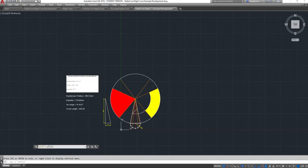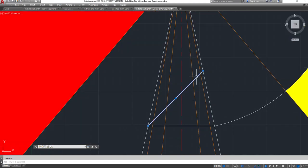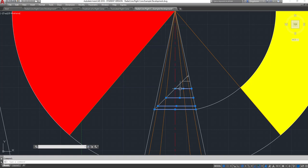For the truncated cone, on the base in the plan view I've broken it into six equal points from zero to six. These project vertically up to the baseline, then those lines project on the angle all the way up to the apex, going through the 45-degree line. The swing points have to be projected to the very outside edge. Some videos online take the apex line to an intermediate point and swing it - that's not a true length. It must go to the very outside edges before you can swing it.